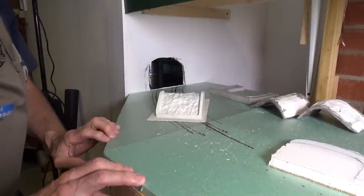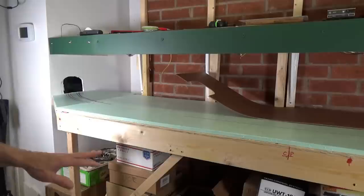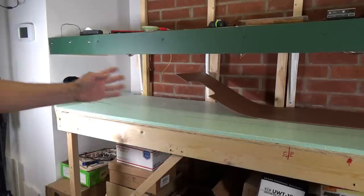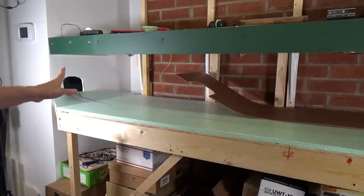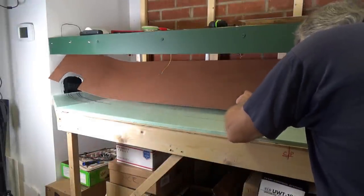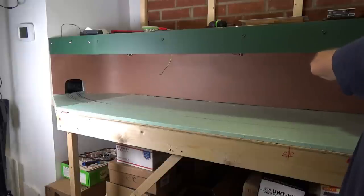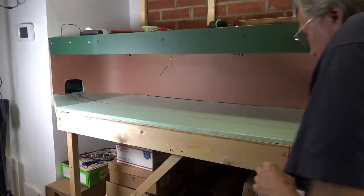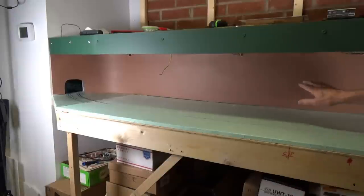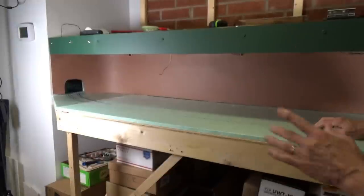Let's go ahead and remount the hardboard for the backdrop here with this section, and have it bend around to form the face of the tunnel. I'm going to flip it up into position and work it so I can get it in there without knocking anything loose. And there we go — very easy and simple to do. I've got it popped into place down at that end. Now I'm going to go ahead and drill the holes for the drywall screws, get those countersunk and installed on these uprights, and then add the joint compound to them.